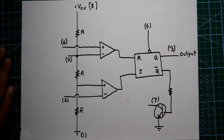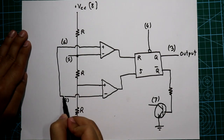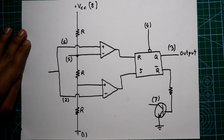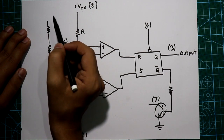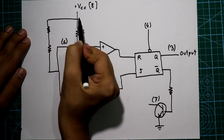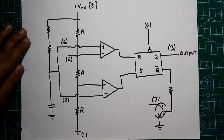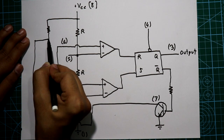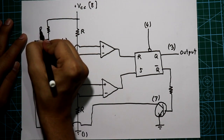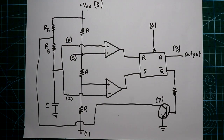This is the internal circuit of IC555. Now for the astable mode we have to connect pin number 6 and 2. Just connect both and then we will take one connection from here. Now we have to add two resistors in series. One end of this series resistor will go to plus VCC and the other end we have to connect one capacitor, then it is connected to ground. Pin number 7, that is the collector of the transistor, is connected here between the resistors. We call this resistor RA, this one RB, and this one C the capacitor.